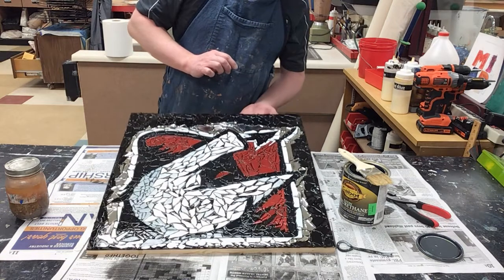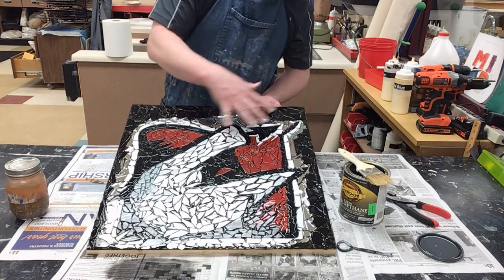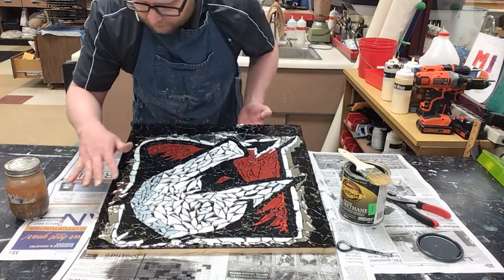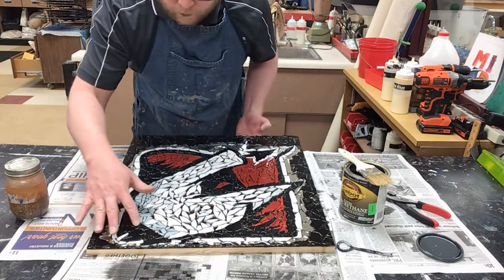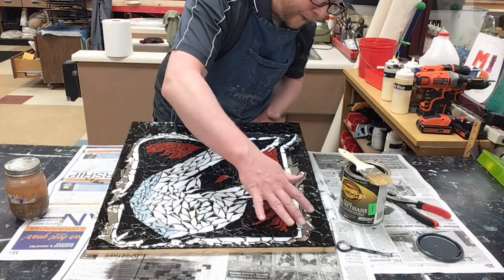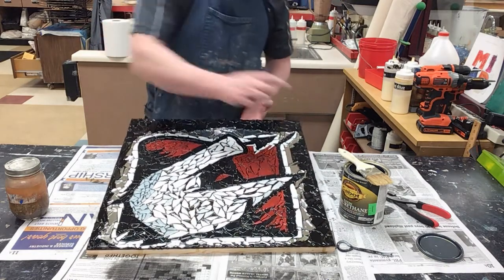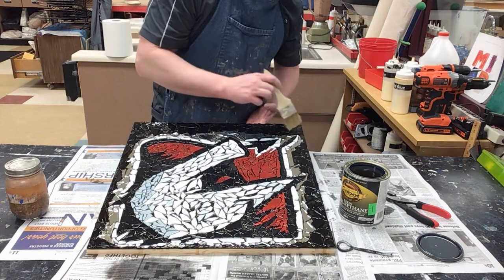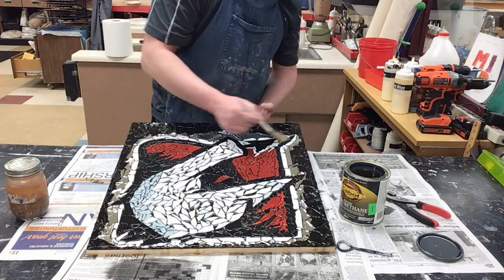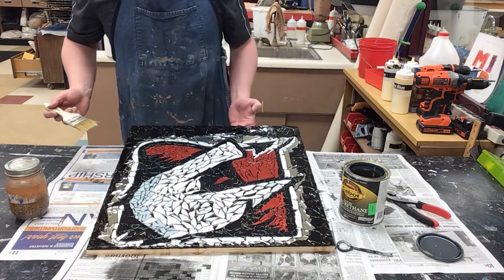So I go back and forth because, from my perspective, it's really glossy right here. From yours, it's down here. So I'm going to look in your area, and I go back and forth with it, moving that light back and forth, watching that gloss hit. And if I noticed anything, for instance right here, if it was not super glossy because I could see those brush strokes, then I would just go back and touch it up a little bit, and you'd be fine.